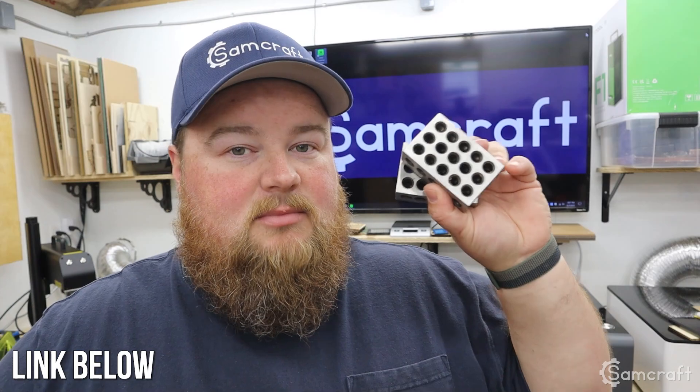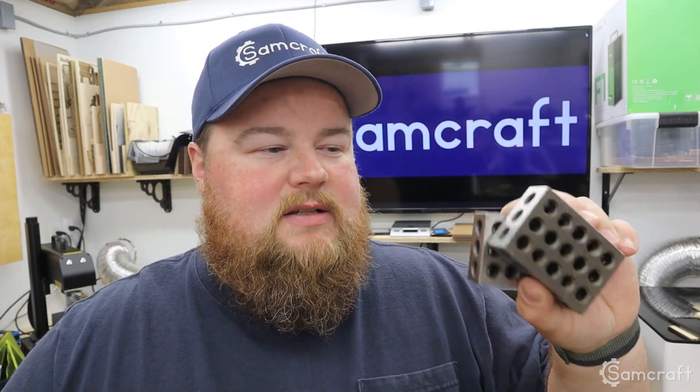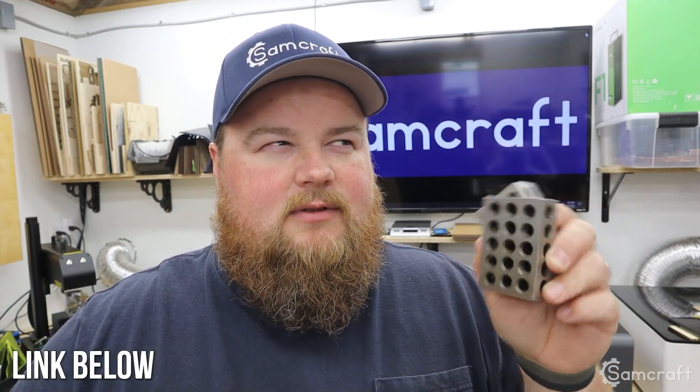As far as the tools you're going to need, the things outside what you may normally have are digital calipers — although you really should have these already — a digital angle finder or digital protractor, and machinists 1-2-3 blocks, or square blocks. In addition to these, you're going to be using some metric Allen wrenches, a Phillips screwdriver, some masking tape for your lens adjustment. Those three specialty tools are the ones you may not already have.